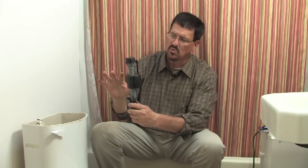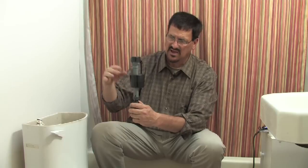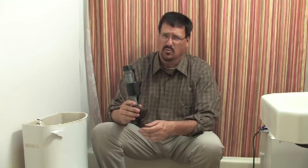Adjustments can be made right here — this is the linkage and it controls how much water goes in. If you have a little extra water going into the water closet, it's overflowing, and it would cause your commode to run and waste water. Typically, you let the water level go nearly to the top of the overflow tube — you'll be able to see that. Then flush the toilet and if it flushes fine, you're good.